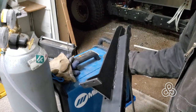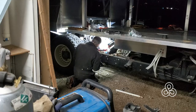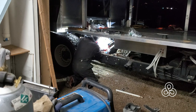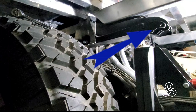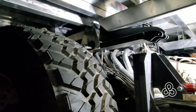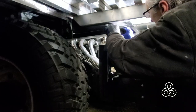Here it is all finished and painted up with a nice thick layer of chassis black paint — painted well so you won't worry about galvanic action between our aluminum and steel parts. That new gusset plate has a little notch in it so it can be held in place — slide that notch over part of the fixture and it holds while we get our bolts back in. There are three bolts from the top, two from the sides, holding our fingers right in position to accept the shock absorber. Then we get that coilover bolted back into position.